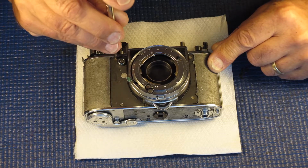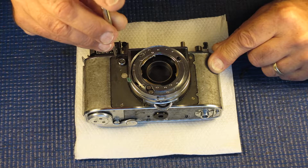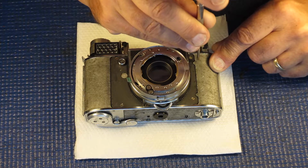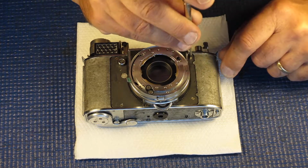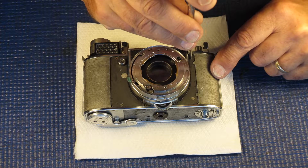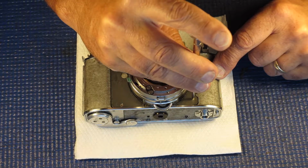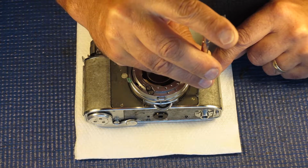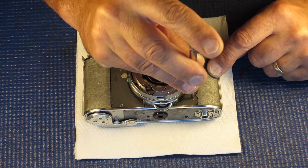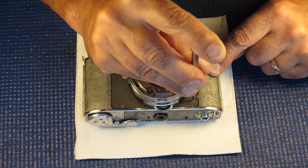If you've only got one camera, and if you've only got the standard lens, this is perfectly acceptable, because you'll set the focus of your lens to suit the body afterwards. On this side, you've got more of a step here, you've got to watch that. Just run it over on these points. It's a little bit higher there. Just tighten that up slightly. Of course, doing it this way has one advantage. It means that your leatherettes won't show a sharp line across that joint, because both surfaces will be at the same height. It's not necessarily the correct height, but never mind.